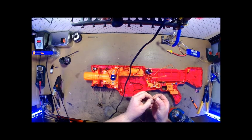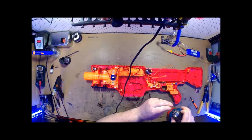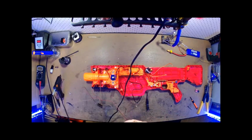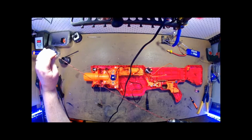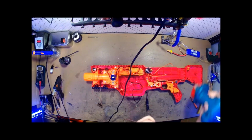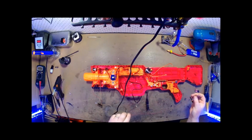Get them nice and parallel, and if they're really tiny, put a little elbow in them. Not too tight, but tight enough. You get your length of wire, pull it out reasonably taut, hold it at that end, and then you get a nice set of twisted wires that you can run together but not be a pain in the buttocks.